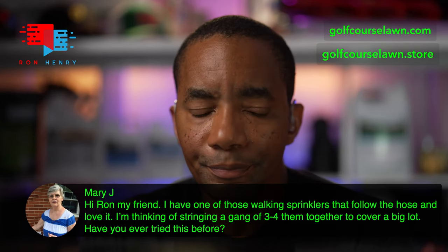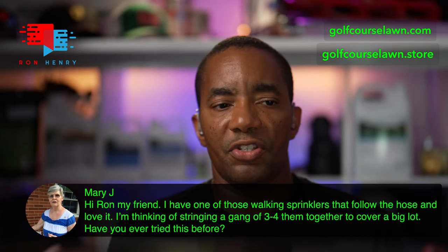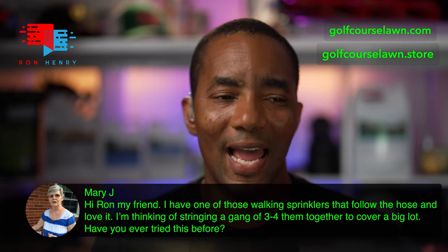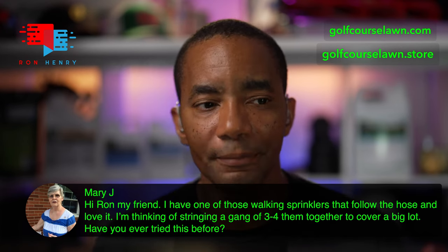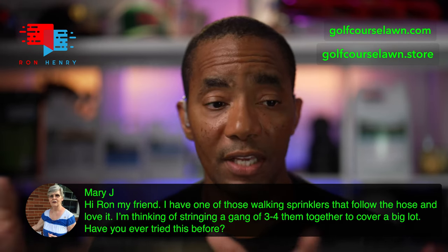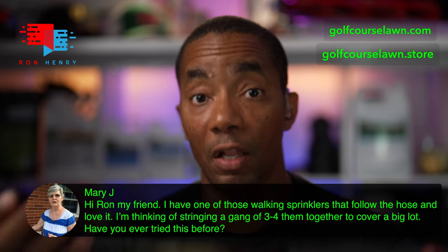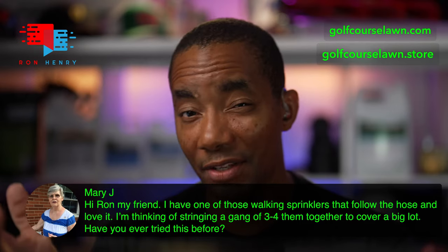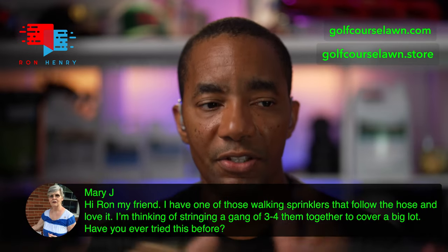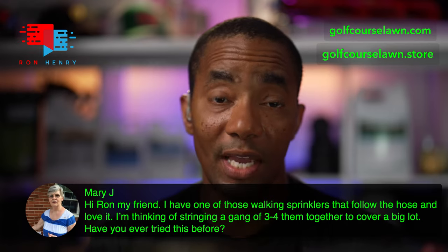I've not tried it, but here's something you might run into, Mary, which is pressure. The pressure coming out of your garden hose attached to the house isn't typically that high. So if you start dividing that pressure across three or four of these sprinkler heads that walk and move, you might find that you don't have enough pressure to run all of them. I might get one more and try it and see, but I'd be surprised if you're able to get four of them off of a single hose and still get a good result.